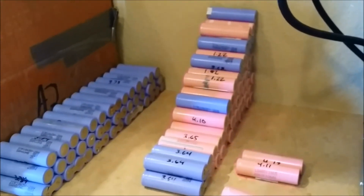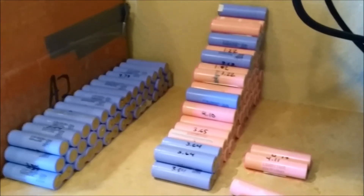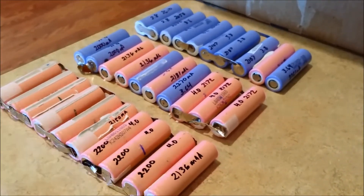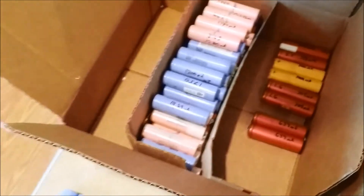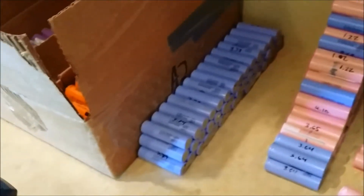It's 13 cells deep and 10 deep for amperage. I've calculated that I'm going to get about a 27 amp hour battery pack out of this using these cells. The ones I've finished - these are 3-amp cells when new - and I've been getting about two thirds or better amp ratings off of them. A lot of the remaining batteries are between one and two amps and I don't really want to touch those yet. The ones rated 2.8 amp when new - some are pretty good, some are not. I've also got a few 3-amp ones hidden away somewhere and a whole box still to go through.